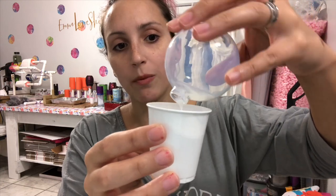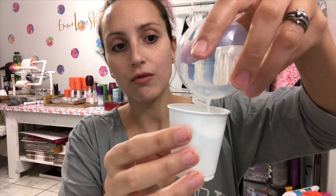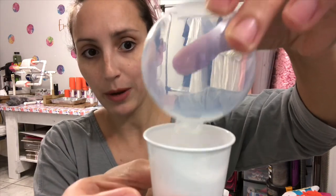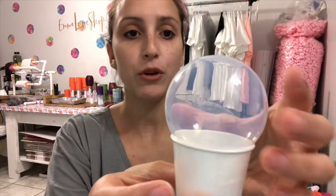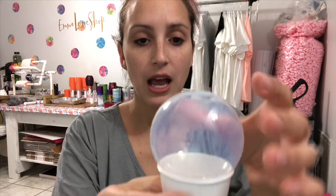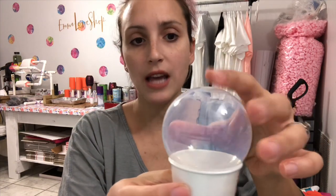Let the rest of the polycrylic drip out into the cup. While it's dripping, you can turn it around so the inside gets nicely covered, then let it drip inside the cup for a few minutes so we don't have any runoff. I like to tap it down so the excess can drip out a little quicker — it's not going to damage anything.